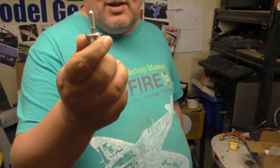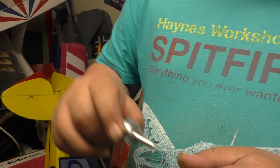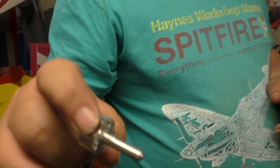The maiden of the DW hobby Fokker Eindecker. So let's look at the carnage from last night. Here is the prop adapter, and that bolts onto the front of the motor with three screws. It might not be easy to see, but it's got Brewer's droop. It's bent. Basically every time, if you catch the prop, bang, it's gone, because we're running a big prop on this motor, and that is the problem. And that's only a 6mm shaft, and it's cheap Chinese aluminium. It's really soft, that stuff.